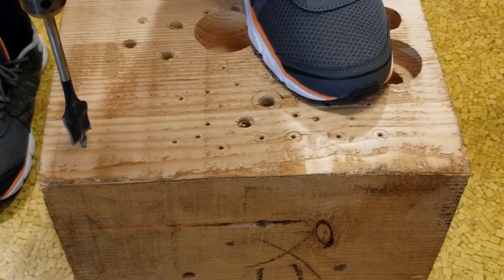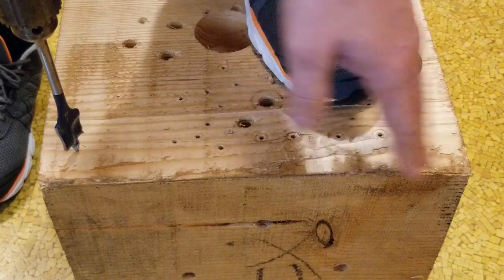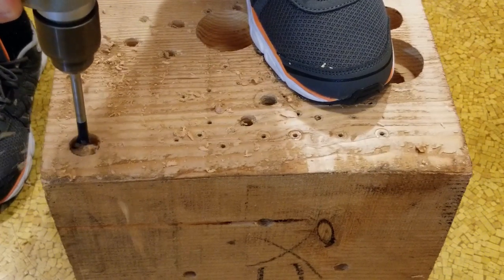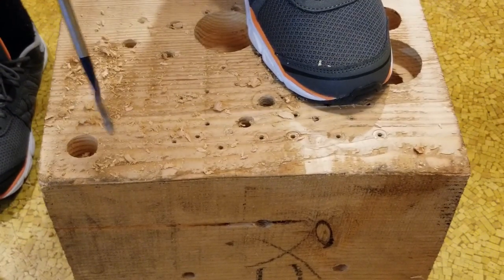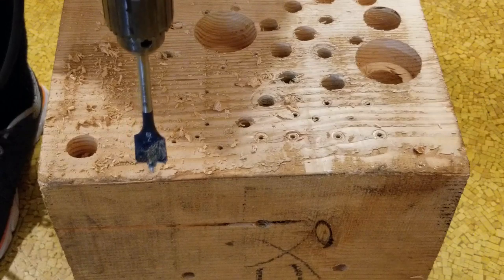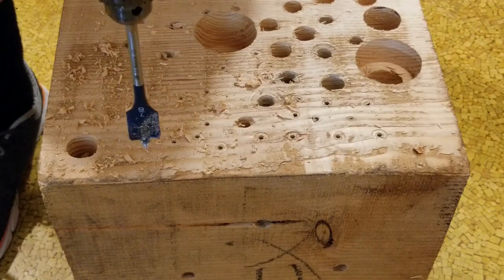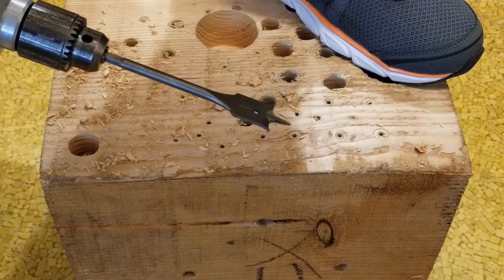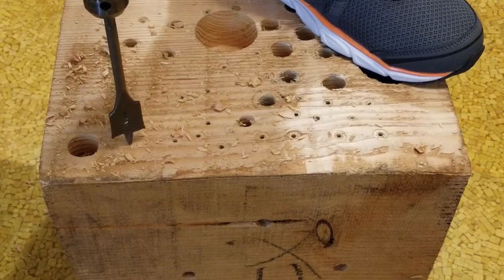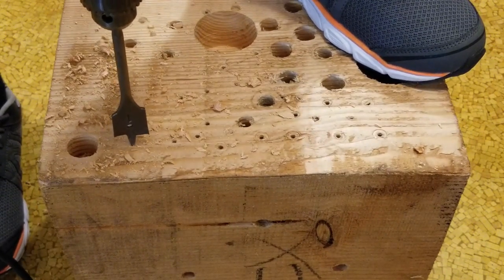We'll start off with the new Daredevil here, but we'll let you watch all the drilling — it's always kind of fun. These are all 7/8ths; a couple of the ones are a little bigger, the best I could do. The self-feed bits — one thing I forgot to mention is once they're screwing in it's kind of hard to stop and try to pull it out because it has screw threads on it. It does make it a little bit more difficult where you do want to go partially through, because you have to reverse the drill to get them back out. I need to get some more dimensional lumber because these bits are really made for doing through-holes as opposed to blind holes, which are holes that you don't go through. But they are still the most common type of bits, so many times people are using these to do blind holes.